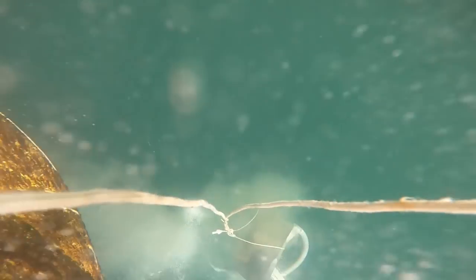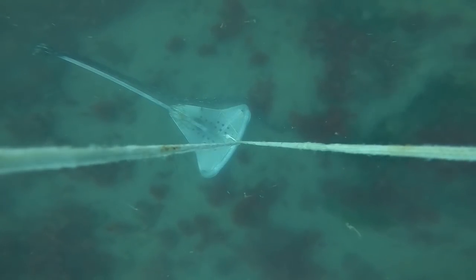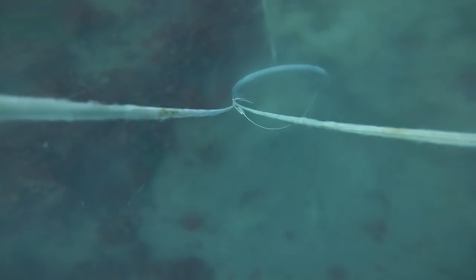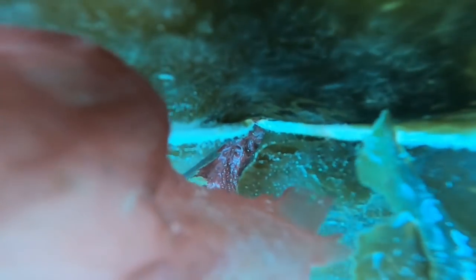Next test is the reset testing. We are in the same seabed, sandy mud. Same scope, 3.5 to 1, and this is where I drive the boat up and over at 3.5 knots to simulate a very aggressive wind or current reversal. Most of the modern and even some of the old-fashioned anchors can pass this test perfectly. This anchor cannot. In the unmodified condition, it drug every single time, and it never even really hooked up and produced any holding power, even if you let it come to a complete stop.